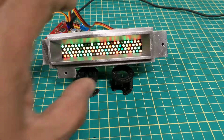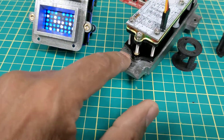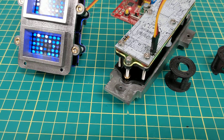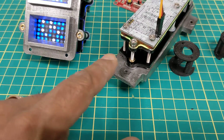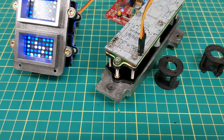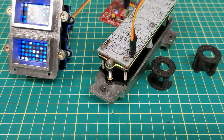For mounting this, I've got some diagrams of that. Inside here I've just epoxied in an M3 insert, because this is resin so you can't heat-press them in, so I made enough room to glue them in and they're pretty solid.